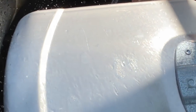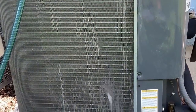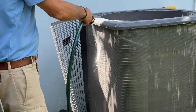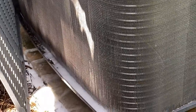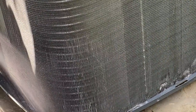Come out here and you'll see what I'm talking about — see how the water is going through, pushing any excess dirt out that might be in there. You also want to rinse off the bottom. Same thing, top to bottom — if you look closely you can see the dirt coming off. This unit is about two years old, so look how much dirt you can get in just a couple of years. Then go inside and rinse off the same way.